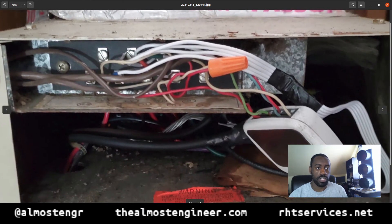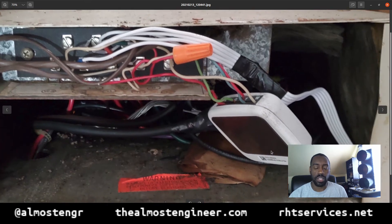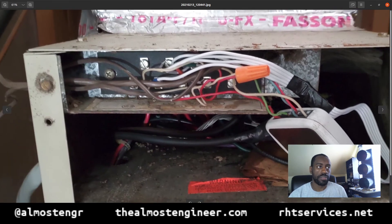This control box takes the signal being sent from the thermostat and converts it to a five-wire setup done correctly — that way you're not having to run new thermostat wire to connect up the unit. Because of how this unit is set up, this would not fit in the space. So what I ended up doing was folding it back and allowing it to sit in this space here. On this edge I put some electrical tape to make sure that the wires, if they move, don't cut themselves on this edge and short out.